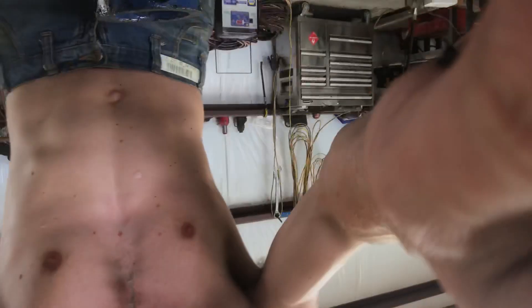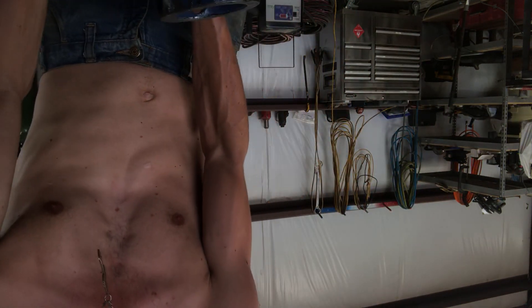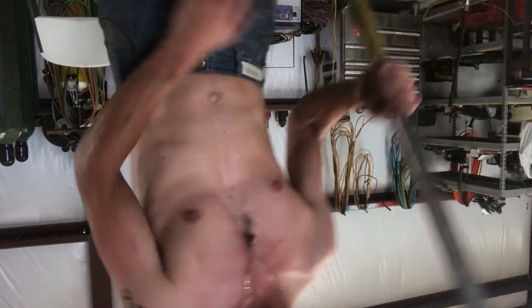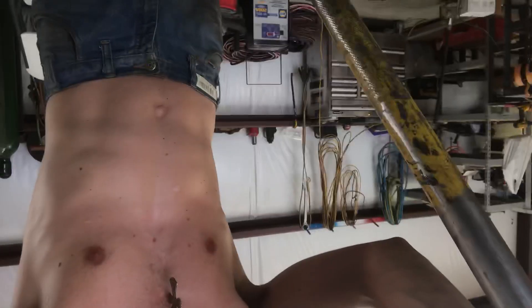Start tightening her up — just give her a snug. Now she's closed, snug her up, flip her back over. Go ahead and take our retainer, get it turning into our valve body — got the threads started. At this point you can turn it however you like and use your valve bar. Go ahead and set your retainer — just gonna turn this until our threads are all the way inside the valve body.